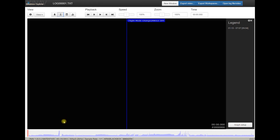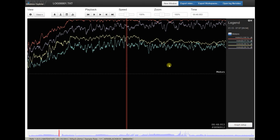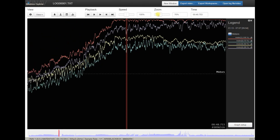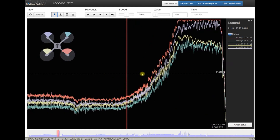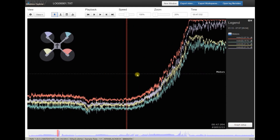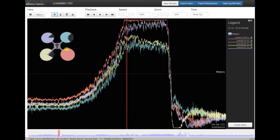Ryan's log opened, let's see what we can learn from it. The first interesting place will be this moment when Ryan raised his throttle. Step number one: let's display motors and what we can learn about motors. This is interesting — looks like one of the motors in Ryan's multi-rotor is either not behaving correctly, has a damaged propeller, or something else fishy.